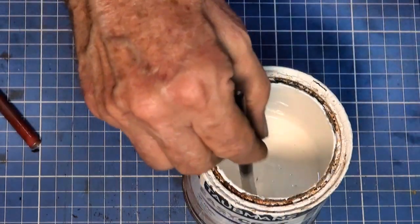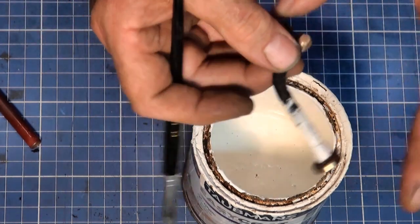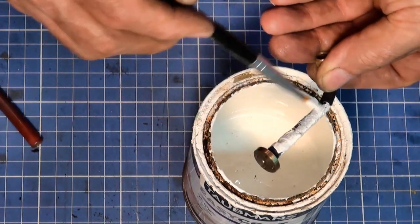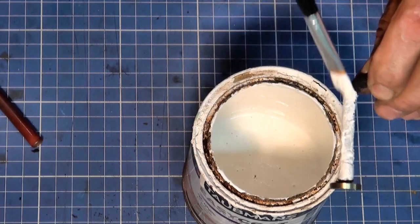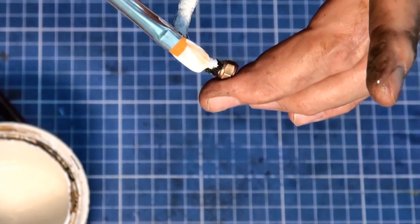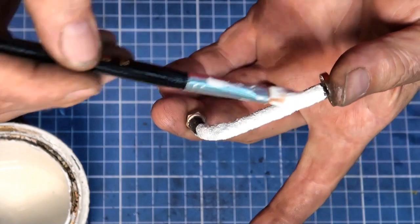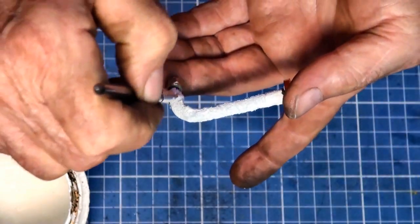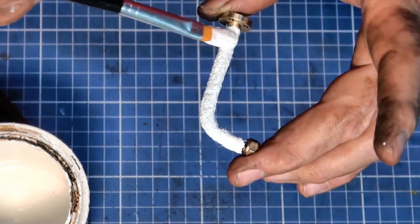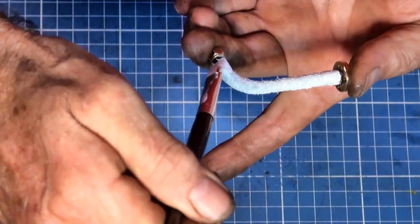The next step in this process was to simulate the look of asbestos. Now, you didn't think I was going to leave this looking black, did you? So what I did then was I found some white water-based primer paint, and I was able to coat the black surface with the white paint. This did a pretty thorough job, and I was surprised actually that it covered the black cloth so easily. I did end up doing two coats, and I sanded between coats, but the end result is a pretty close approximation of what asbestos lagging would look like.